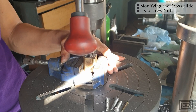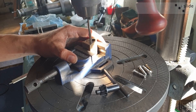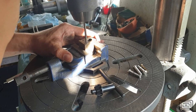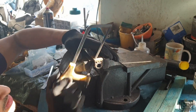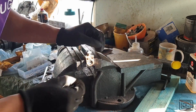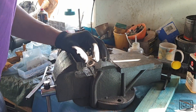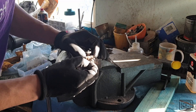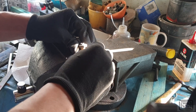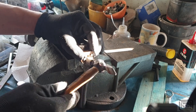I have quite a lot of backlash in my cross slide. It's not that much of a problem because I run DROs, however it just feels nice to have a snug lathe — and that's what I'm trying to fix here. I've got the actual nut and I'm going to split it in half. Before I do that I'm drilling three holes: two on the outside that are drilled and reamed for dowel pins, and the central one is for a bolt. I'm using that bolt to push those two halves against each other when the lead screw is in it, so it preloads the whole lead screw assembly and eliminates backlash. The lathe feels a lot nicer to use now.